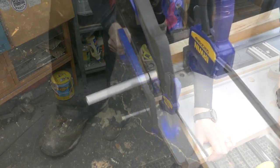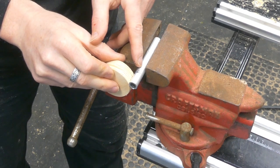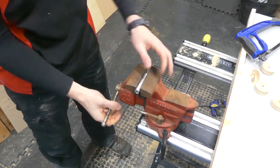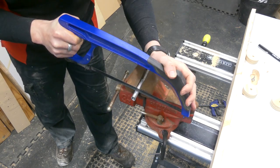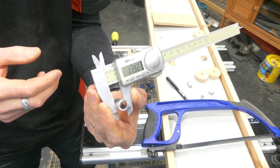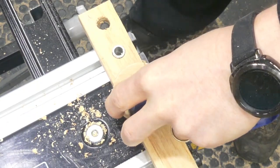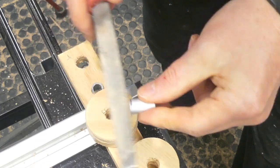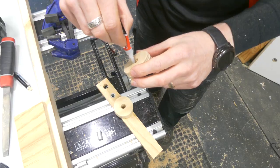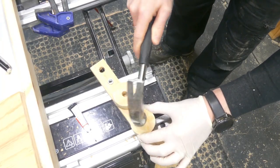I was trying to use my sled as a bench hook and my neighbour took pity on me and gifted me this 3.5 inch Craftsman vise. Unlike my other vise, this one actually works and god it made my life so much easier for this project. The aluminium pipe I'm using is 12mm or half an inch, so that's what I had to drill my wheels out to. Effectively this pipe is going to be the bushing. So I roughed up the outside of it with some sandpaper to help the super glue stick, and hammered those little bits of metal in so that hopefully these rollers last a while.